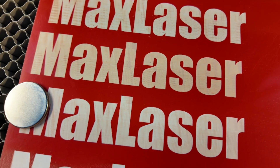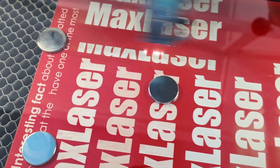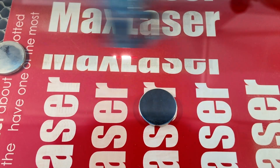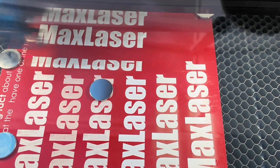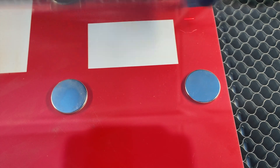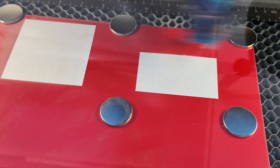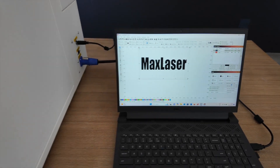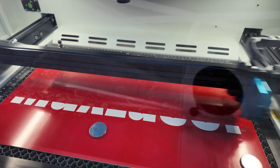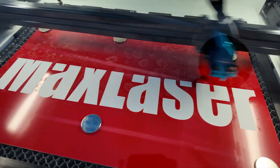I did quite a few more tests - from 3.6 I went up to 3.7 and 3.8, keeping the same power and speed, just slightly increasing the out-of-focus distance to see if I got a better result. I actually wasn't getting a better result so I went back to 3.6. Then I tried taking the air assist off. You can see on the right block it's without air assist and on the left was with - there was definitely a much cleaner, whiter result without air assist. So I decided to do the full sign with big bold letters.